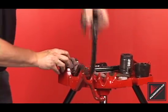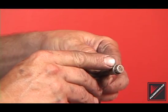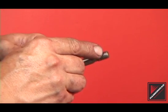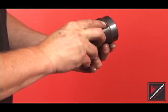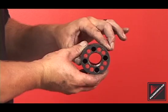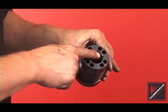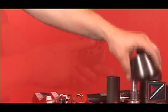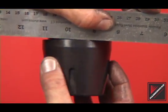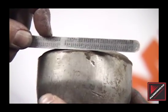Remove the valve from the chain vise. With the rear assembly disassembled, complete an inspection of the components. Inspect the tail bolt heads and threads for damage — if one or more tail bolts are missing or damaged, replace the entire set. Inspect the threads of the rear anvil and use a thread file to repair any damaged threads. Rear anvils with broken threads should be replaced. Check for debris inside the bolt holes and exhaust ports. Clean as necessary. Inspect both rear anvil stops for wear. Inspect the tail cone for damage and debris. Check the tail bolt holes for wear. Use a straight edge to check the mating surface. The mating surface of this tail cone is damaged — the surface is not square and has mushroomed from a previous incorrect installation.